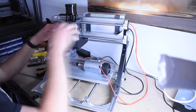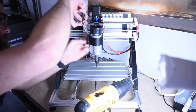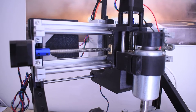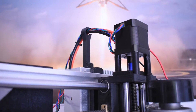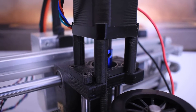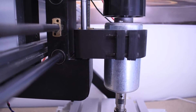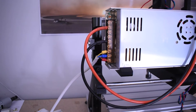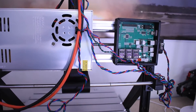After feeling confident that the x-carriage moves smoothly along the rails, it was time to reinstall the screw rod, the x-axis motor, and get the spindle motor installed back into the mount. Here's a final look at the majority of the upgrades on the machine — the only thing left to install are the limit switches, which are really straightforward. I added a cable holder at the top to stop cables rubbing on the power supply. Here's another shot of that cover I designed to eliminate that major design flaw from the stock design. On the new motor bracket I increased the spindle distance from the rails to ensure the fan won't catch the stepper motor at the highest z-range. And here's a shot of the back showing the power supply and board mounting.